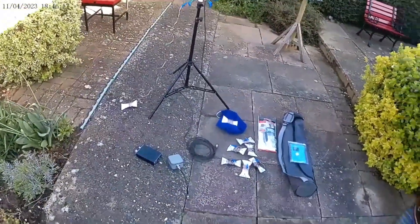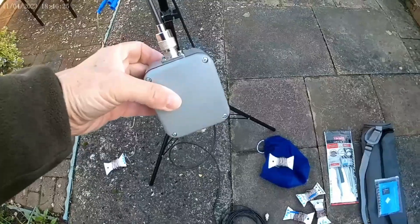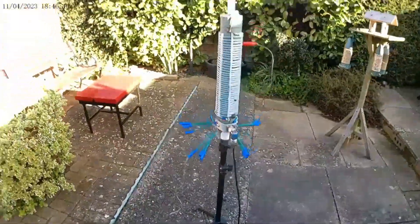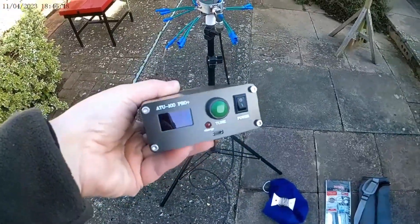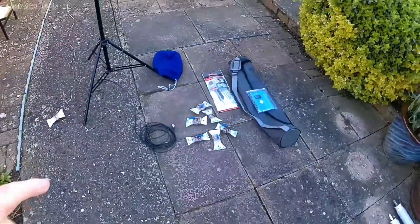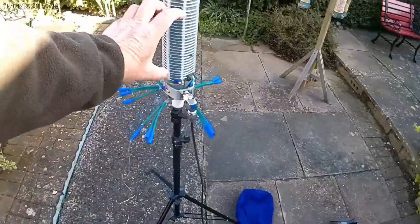There are a couple of bits I don't always carry. This one I can put in-line in the cable — it's a common mode choke and it stops any RF coming back down the actual cable into the radio. Or if I want to use some odd bands and this coil doesn't really match, I've got one of these battery-powered automatic tuner units which I can insert, but I've only needed that once. In addition to this kit, I can actually fit my new coils onto the same system — these coils here can attach to replace the existing one in the same manner.